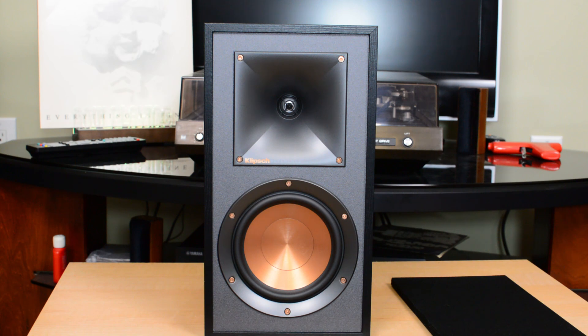I'm going to see if I can make them better with a few minor modifications, but first I want to see what the makeup of the speaker actually is. As the first test, I'm going to check for polarity. I'm going to turn off some of the lights and do a polarity test to see if perhaps the tweeter is reverse polarity, which is sometimes necessary depending on the crossover.